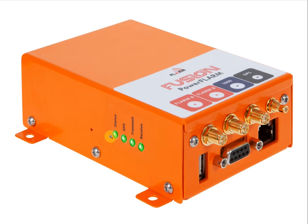One thing you may notice is that now, instead of the one flashing LED that had different colors and different rates of flash that meant different things on the Core, there are now four different LEDs — one giving us the status, one giving us the GPS, and indicators for whether we're transmitting or receiving on FLARM. That's an improvement, allowing us to get a bit more information at first glance when we look at the instrument.